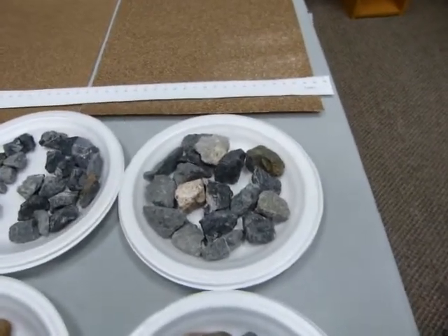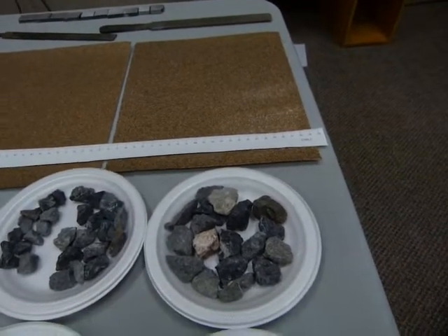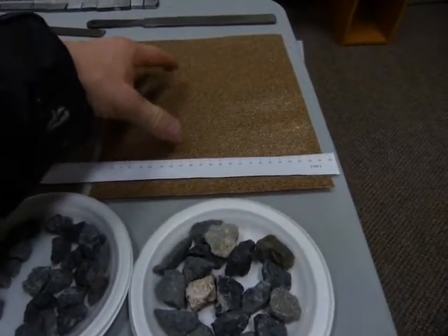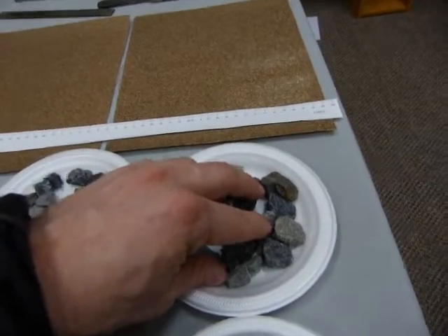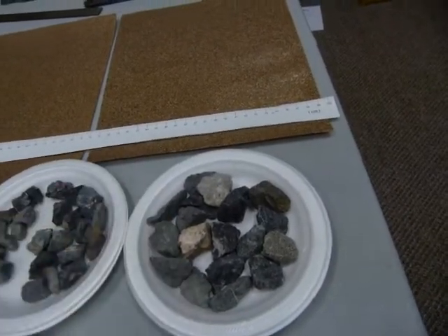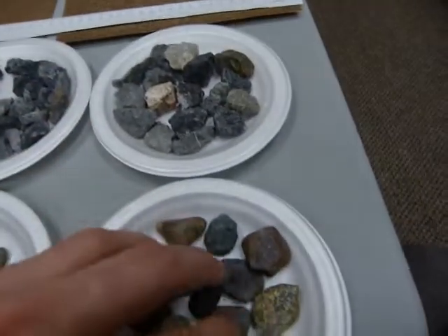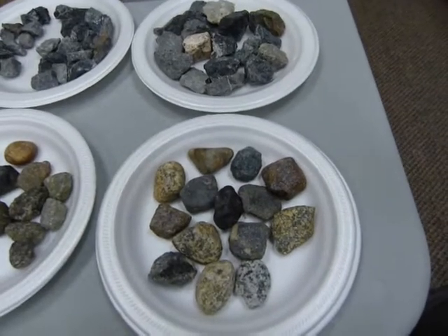When you start sanding, this is how you can save some headache. Sandpaper is cheap — maybe 10 to 20 cents a sheet — but your wages are expensive. When it's fresh, all the individual abrasive particles have sharp jagged edges and they tear out material, wood or metal, whatever you are sanding, corresponding to the physical size of the rock used to make the abrasive product. In use, these rocks get rounded down and worn, and they do not remove wood or metal anywhere near as effectively.